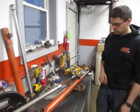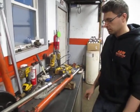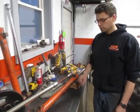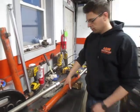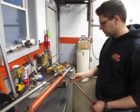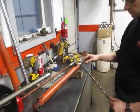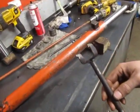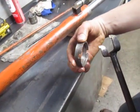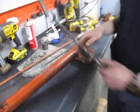After it's off and cleaned up, the first thing to do is secure the cylinder. Some people will just grab them in a vise — if you do that, don't crank the vise too hard, otherwise you risk crushing the barrel onto the piston or rod inside. To disassemble this, you're going to need some sort of customized wrench to turn the nut off the end. I made one here out of some square tube and some round stock. What you need to accomplish is to grab these two grooves in the nut with the wrench to turn the nut out.